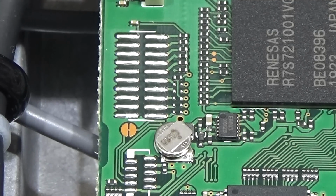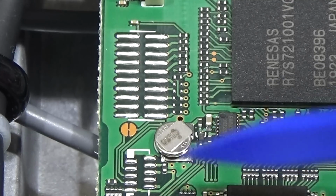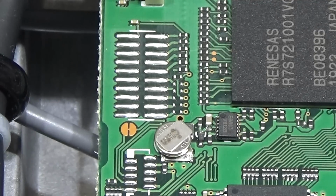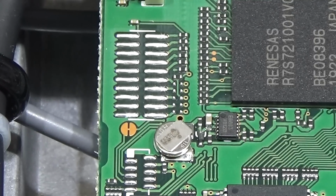I mean, if that were a commercial product, for Marines or for avionics, for example, then those radios would run every single day, and this little battery gets charged, right? So then I believe it is not a problem. But with a ham radio it is a little bit different, because it always depends how often the radio gets used. So some of these radios will not get switched on every single day. Rather, it stands for weeks maybe until it gets switched on again.